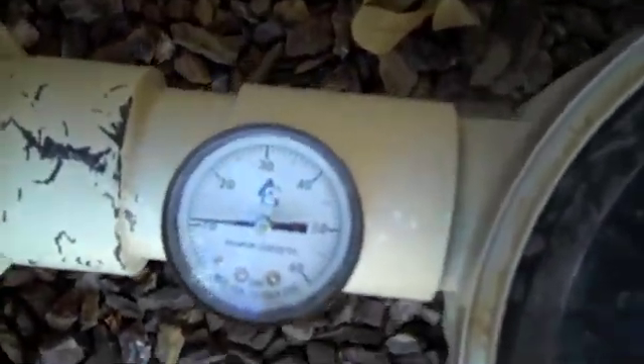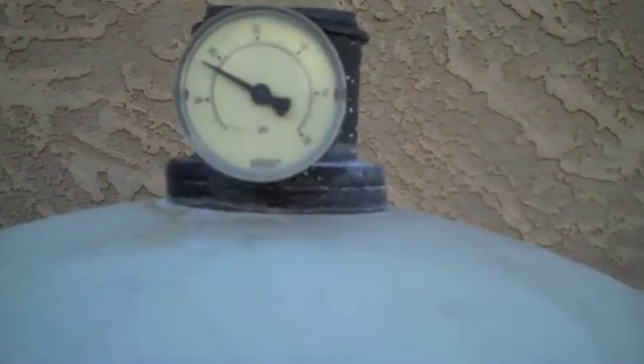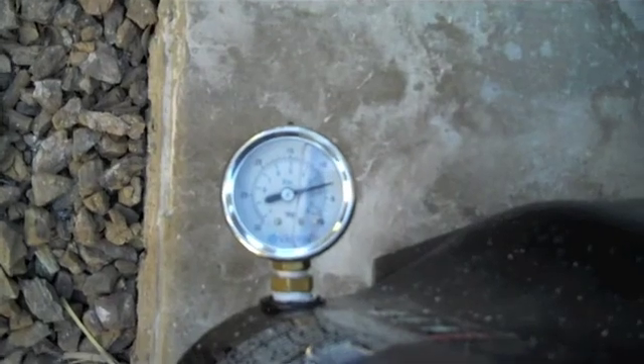We get tremendous action. All of our pump suction is being diverted to the bottom drain, yet we still get full suction at the skimmer. Our actuator valve pressure looks like it's gone down to about 11 pounds. Our filter operating pressure is just below 18 pounds. Pump discharge pressure is about 18 to 19 pounds, and our vacuum is running at about 6 or 7 inches.